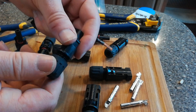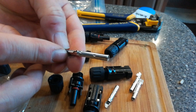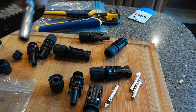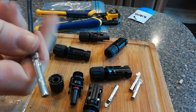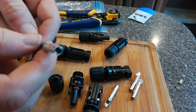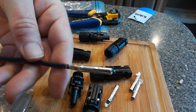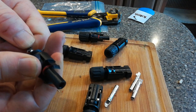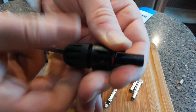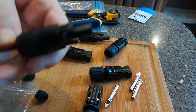So we'll do the male MC4 connector. There are two sizes of MC4 pins — the male is the longer one. I just need to crimp it, put the wire on and crimp it right here. I don't really have the right kind of crimper for this, but it's doing a rough job. I think it'll be adequate. By the way, this is 10 gauge wire. Depending on your length, there are calculators online that show distance and how many amps will pass through — about 7 amps is normal, a lot less with flexible solar panels. It's only one foot of wire here. I'll take the end, put it through there, it's supposed to pop — nice click — then screw it good into shape. Nice hand-tight twist. MC4 connector done.